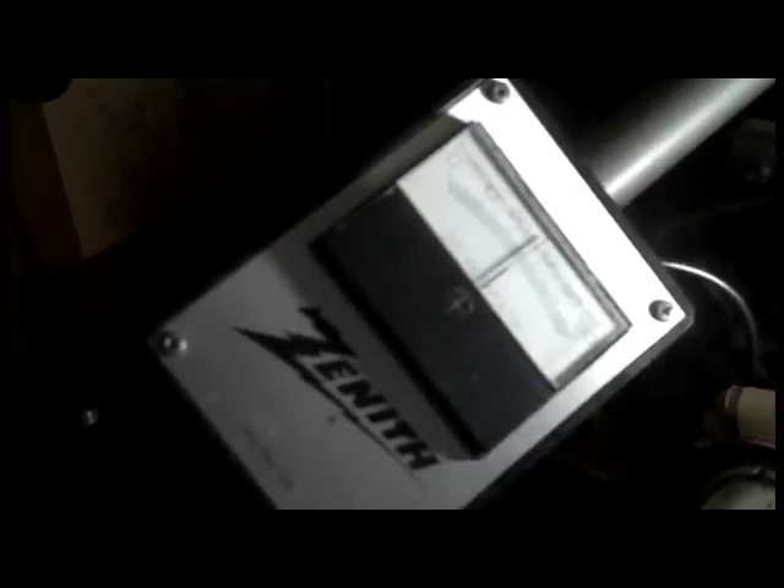I replaced the high voltage regulator tube, and at minimum brightness I can hold it at about 27 kilovolts, and if I crank it up it goes right up to about 38 kilovolts. You can hear the hissing there. This reduced picture size all the way around really interests me — why the conversion to a solid state rectifier would cause the horizontal to be shrunk in over an inch on each side, and the vertical to be pulled up top and bottom.